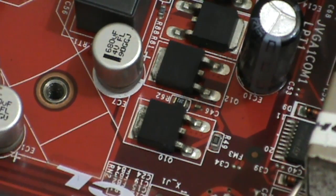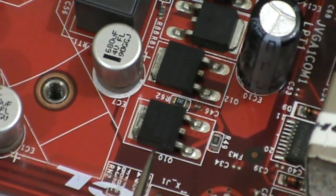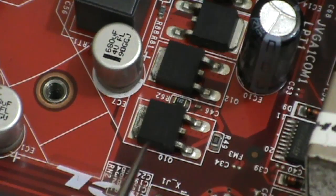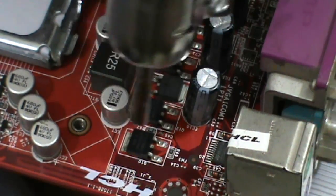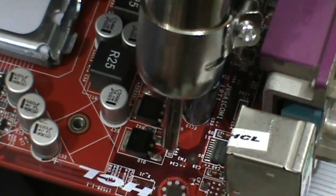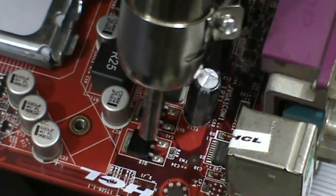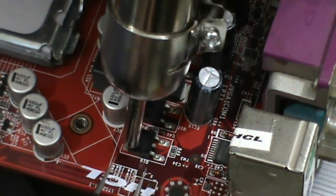then control your air on low mode, otherwise components will burn out or get pulled out. This one is a tiny resistor and this one is a capacitor, so control your SMD rework station air and remove the MOSFET with heat. Be patient — heat your drain point more than source and gate because its bonding is high, then pull it out.